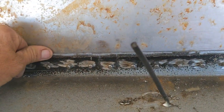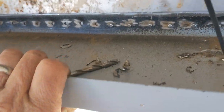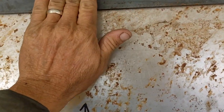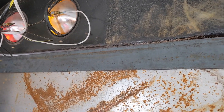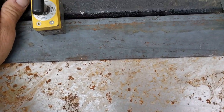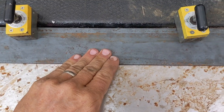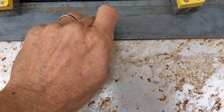Down here, this is riveted into this framing member, part of the eyebrow. And up here, I am installing, now that I've got this sheet of metal tucked inside, I've got this up here just temporarily. I will attach it and then put a brace across here just to prevent any oil canning. You see, this is pretty flexible. So I want to be able to rivet through the outer layer, through this new layer, and into something solid.